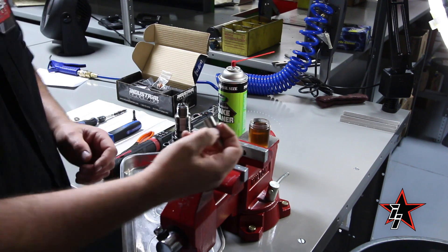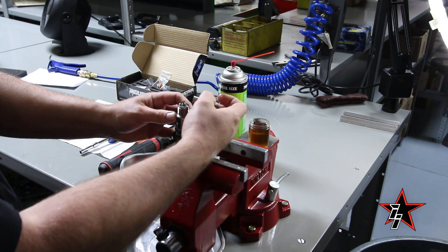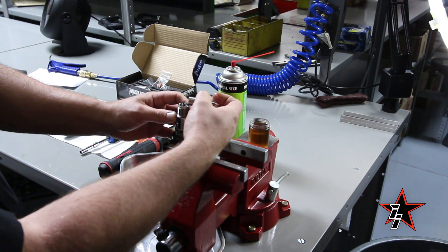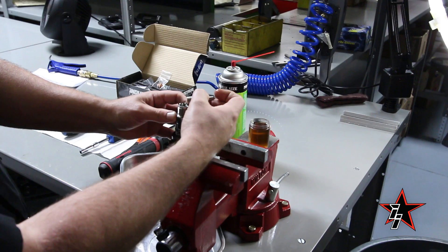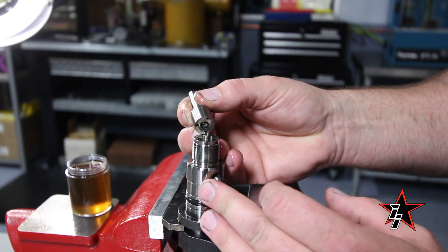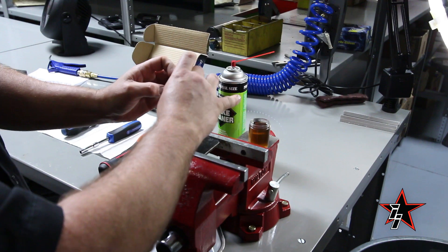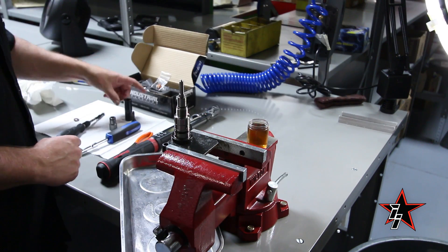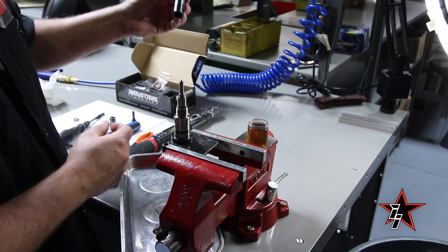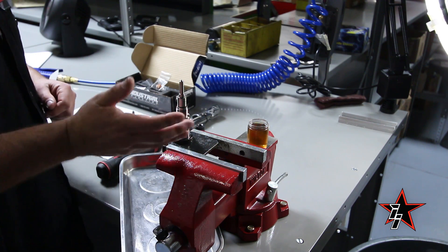When installing the nozzle, I like to go at an angle to line up the two pins — it really only goes one way. Going at an angle keeps the pencil from sliding out. Then I push it back in and quickly drop it on until it sets in there nicely. One thing to mention: you'll also need a 15-millimeter deep socket for torquing the nozzle nut back on. I've got my new nozzle in place and the cap cleaned up.